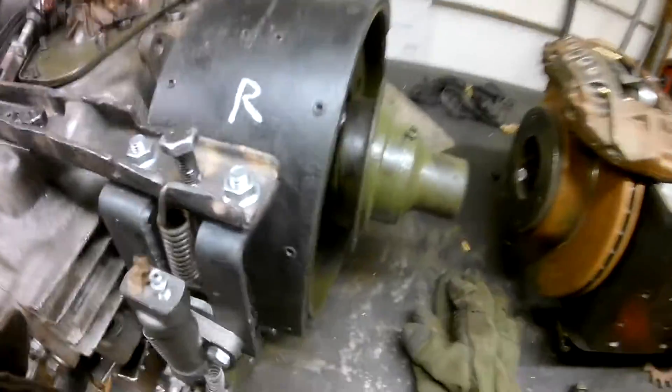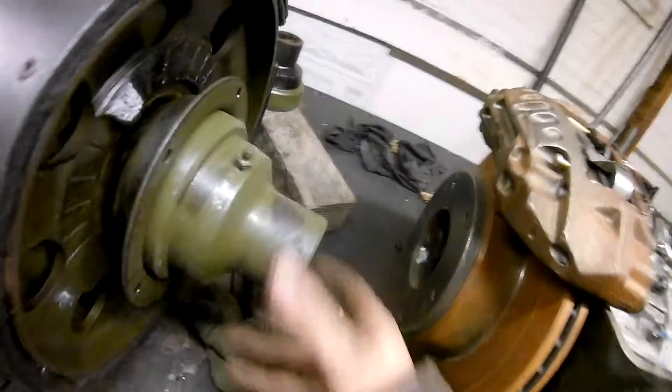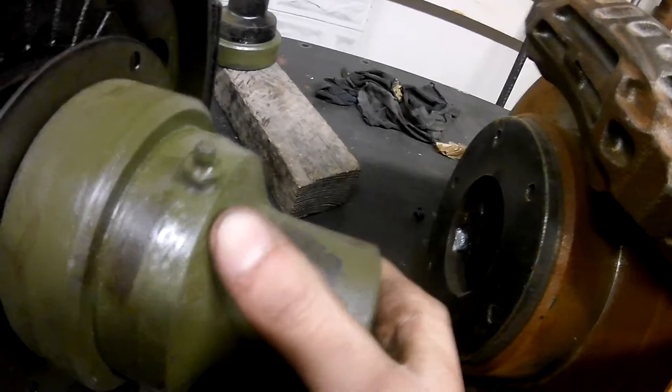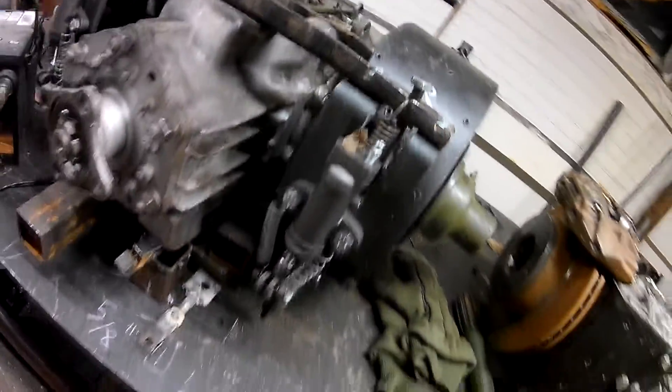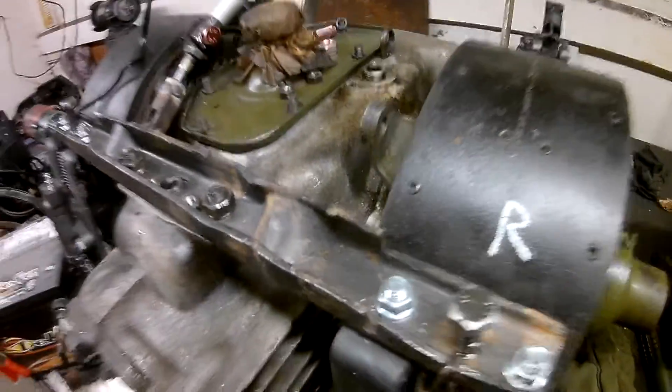The actual output shafts — I don't think I'm going to need to use my own output shafts because I bought some of these as well. These are the output shafts that would go to the final drive in a standard GAZ-71 format, and they slide right in. These are just some couplers that get splined up into the transmission. I'm guessing you have to grease them just to keep the spline wear to a minimum. All of this hardware is just for adjustment — right now the brake bands aren't adjusted, and there's a certain required clearance on certain parts of the bands. There's a lot of dragging going on currently.